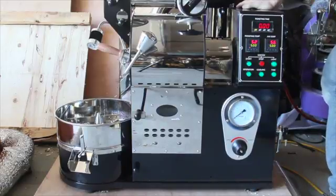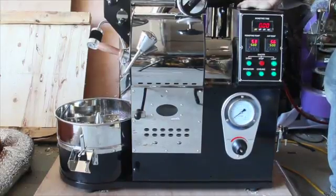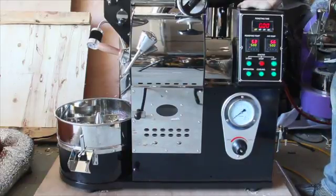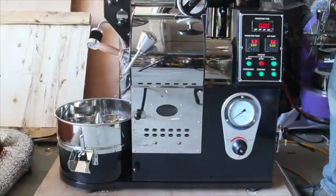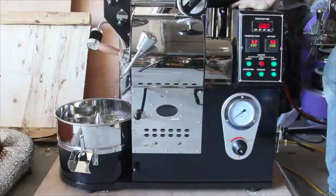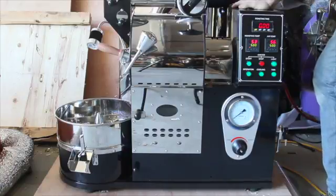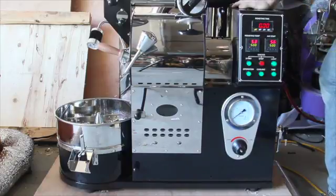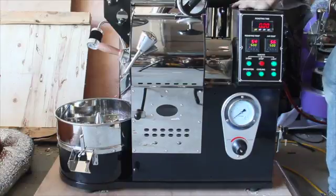Now in the 2017 models, we're making available an option that if you down the road want to add a Fidget to it, there'll be pre-drilled holes for two in the neck of the roaster, and then in the front plate for a bean and ET that can be run through a Fidget, and for profiling. But generally speaking, if you're wanting a system that does profiling, you'll want to go with our high-end Fuji components and the built-in data logging system or computer profiling system, which works through Artisan, and down the road may also work with other programs such as Roastmaster, Cropster, and so forth.